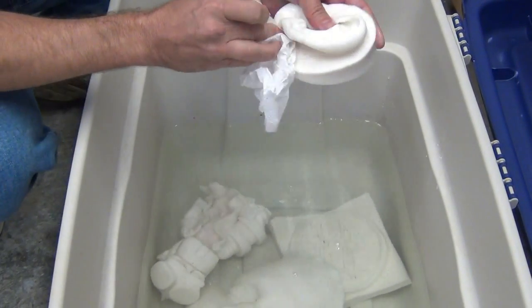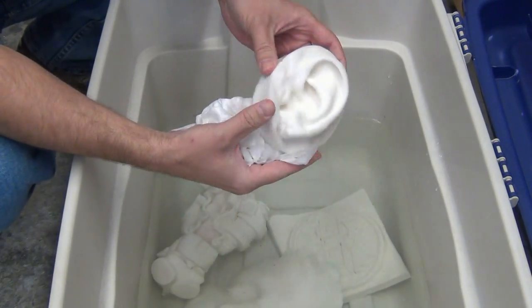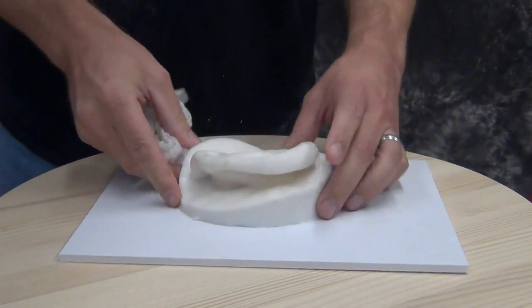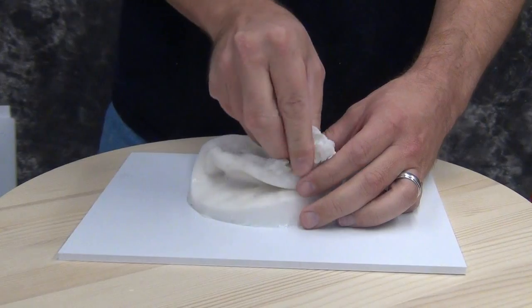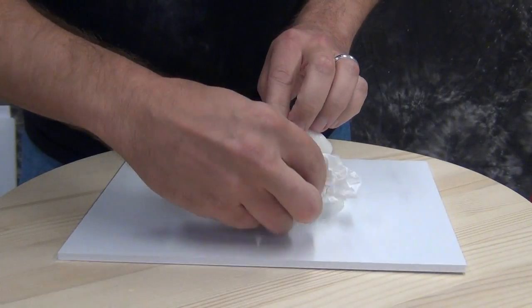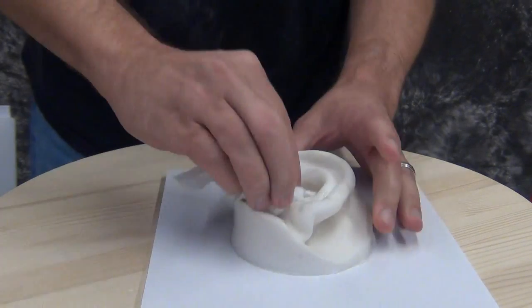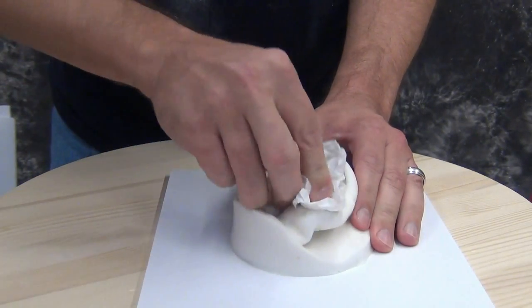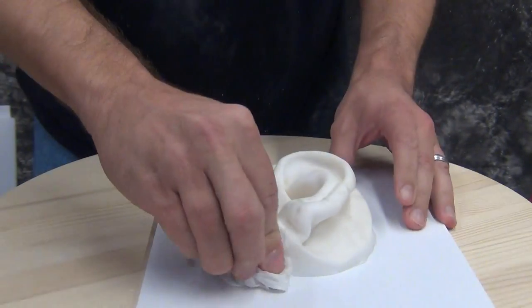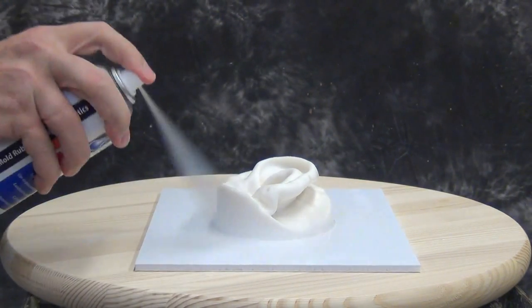For parts with a really thick cross section, those may take more time and you might even have to poke holes in them. Remember that thinner cross section parts respond to this process much better than thicker cross section parts. Now we're ready to dry off our part and make a mold. Mold making over a rubber part like this is really tricky because since this is a wet part that has absorbed water, it's very low density and has the consistency of jello. We can't make a dump mold by just dumping rubber over the top because since it is so low density, it's going to try to float. So I'm just placing this on a piece of foam core and then we're going to spray a light coat of 2500 spray release.